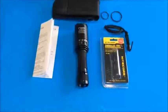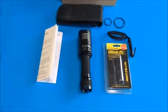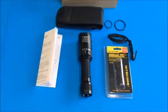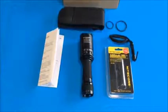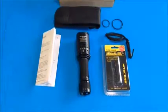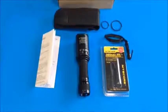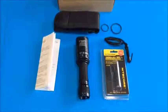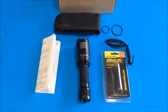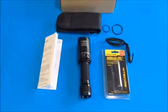In working in the industry, I was extremely familiar with Factory Mutual, UL, CSA, PTB, and the European Union approval agencies. This flashlight carries an approval from a Chinese agency called PCEC, which is a new one for me, but they work hand in hand with the PTB German agency and the Russian approval agencies. The code that it uses means that the flashlight is approved to be explosion protected for Type D or Class 1 Zone 1 approval, for Class 2C, which is a gas group acetylene. It has a T5 temperature rating of up to 100 degrees C, and it's good for equipment protection for gas atmospheres with a high level of protection. It is not for use in mines.